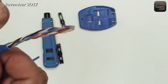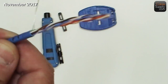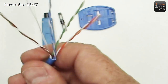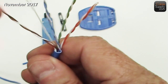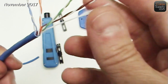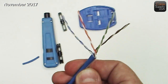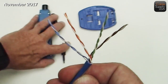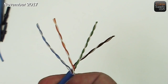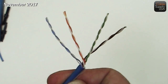And these are your four pairs. If you're dealing with anything other than four-pair computer cable, today the standard is four-pair — it's the minimum, it's what's used. In telecom, computers, and cabling, you only use the word 'pair' — you don't say eight wires. The color code direction is blue, orange, green, brown. Some people ask how you cable for VoIP — it's the same as computers, no difference. VoIP cabling is exactly the same as computer cabling, four pairs.